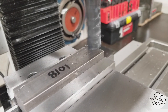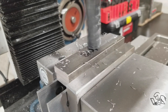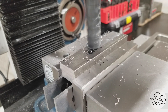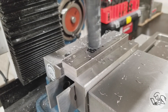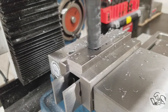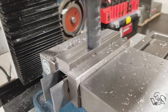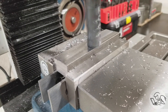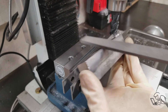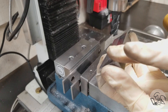I'm going to use this donated Niagara cutter to do the work here. This is a high-speed steel cutter with a titanium carbonitride coating, which is why it has that black color. A lot of people have asked for the part number — it doesn't show up on Niagara's website so it must be discontinued. I'm just taking a light 20-thou pass off this top surface to get it all flat and machined, then we'll deburr that. This is 1018 steel so it can make some pretty nasty burrs, but that's all smooth and nice now.